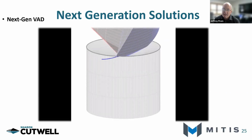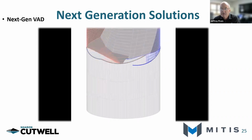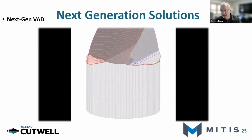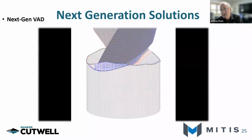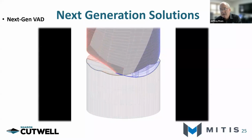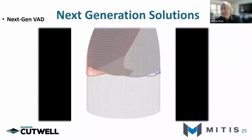Here's a nice video that shows what is actually going on in the micro pecking in the VAD environment. While the drill is advancing through the material, it is making some very small oscillations that effectively are creating nice, small, easy to evacuate chips.